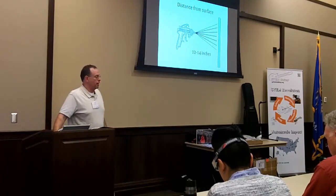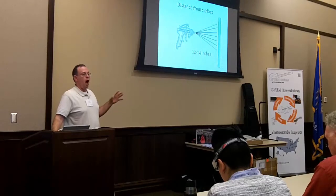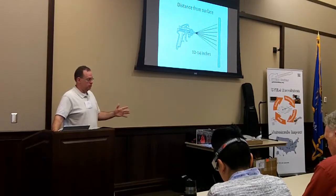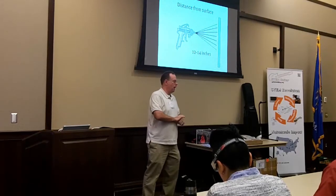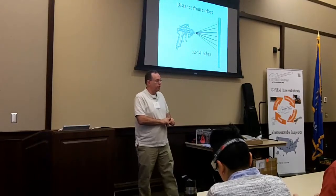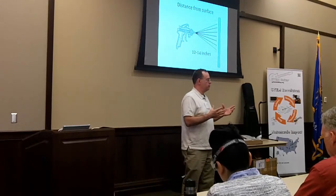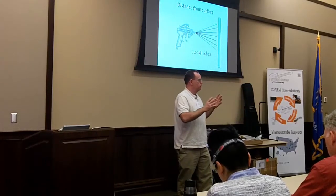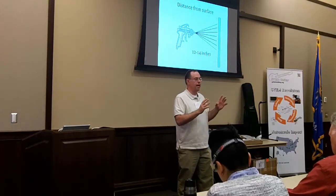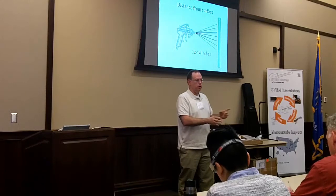Distance from the surface with a spray gun is ideally around 12 to 14 inches. With lower pressure or different viscosity you may get a little closer. I use a spray gun and spray Bona Novia — it's an off-label application, but I've had very good results with it. From observation, it's very similar to what they tout as water-based lacquer in its color, viscosity, odor, and visual appearance.